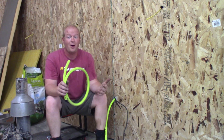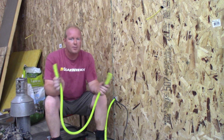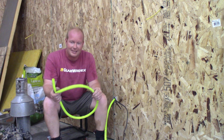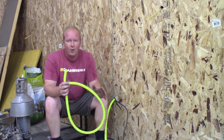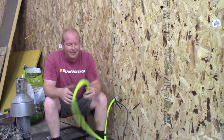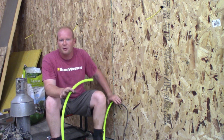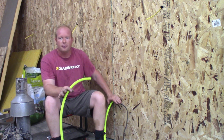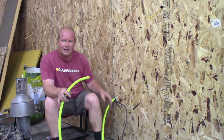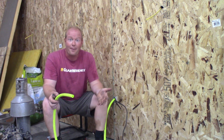I'll tell you what, this has been a project that's been a long time coming, and it took me a while to find the right product to be able to do what I needed to do. A couple of key features I love about this Flexzilla hose from Legacy. Even when it's cold, it stays very, very flexible, and you don't have to worry about it kinking. I'm running about 75 feet underground, about another 10, 15 feet going up and over. And I didn't have to put any 90s in this because of how flexible it is. And now I have full 150 PSI shop air pressure coming to my new shop without the noise of an air compressor.